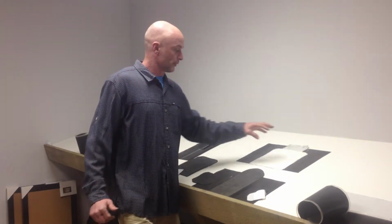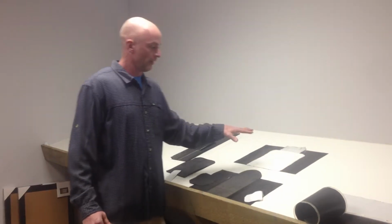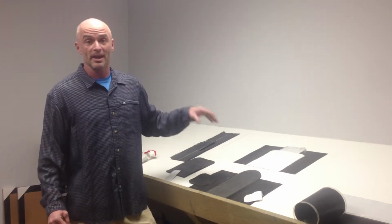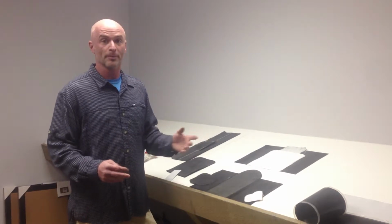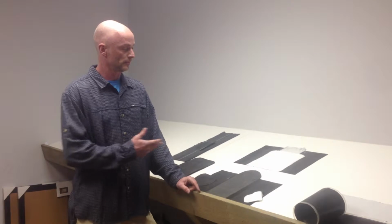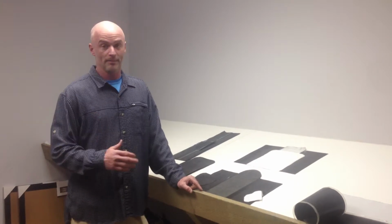So we take these roofs and we recover them with a tape specifically made for old roofs, and then the elastomeric. Both these pieces of EPDM were cleaned with Carlisle's or Firestone's roof cleaner. We did not do what became our minimum specification for any large EPDM restoration we do: hot water power washers, 3,500 PSI, truck mounted. It makes night and day.